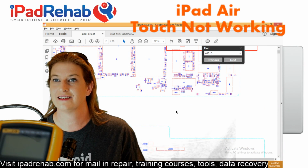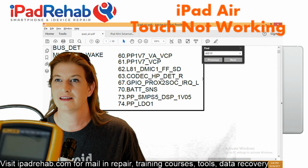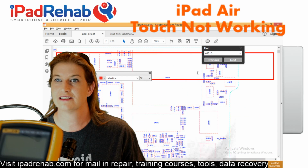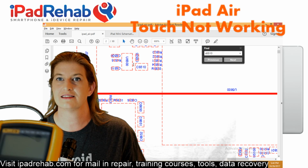All right, let's see. So 6510 and 6515. It's going to be somewhere around here. There we go. So here's C6510, and we already know that this is the line side, and that's the ground side. And then C6515. We already know that this is the line side and that's the ground side. So let's just put a little wire and kind of ding, ding, connect that up.